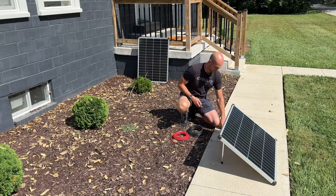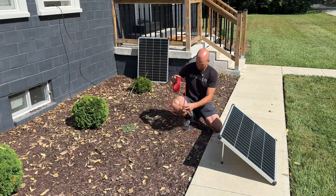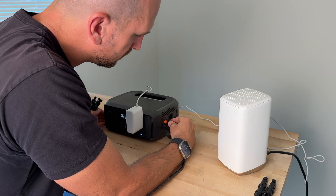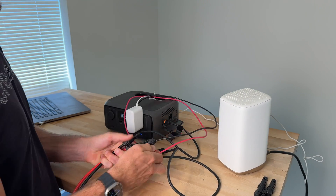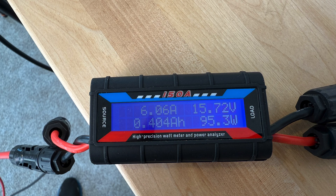In this setup I'm going to keep the EcoFlow on the inside, so I have these two MC4 cables that give me another 30 feet I can stretch from the 100 watt solar panel. This one specifically from Harbor Freight has those little built-in kickstands, which are super convenient. Don't forget some portable power stations need a converter cable that doesn't come with it, so just check whichever unit you're purchasing to make sure you have it. So we just plugged it in and it spooled up — it's very sunny outside so we're getting all the way up to about 94 or 95 watts, with about 16 volts and 6 amps coming from that one panel.